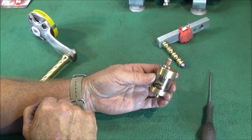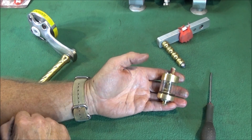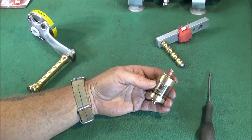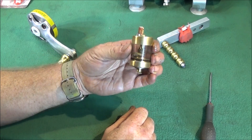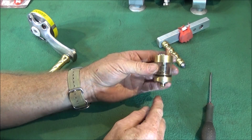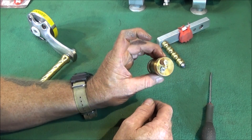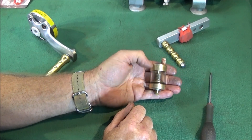If there's any oil left in there I just screw that down at the end of machining, and I'm now saving all that oil that used to go to waste when that side hole was open. Of all the oilers I've ever tried on the Myford ML7, I found this one to be the best — it's very reliable, gives a constant flow of oil in drip form, and having that valve on there now is going to make the lathe a lot more economical to use.